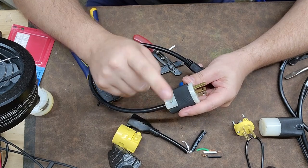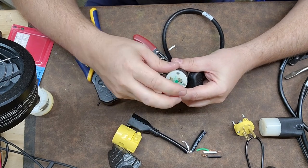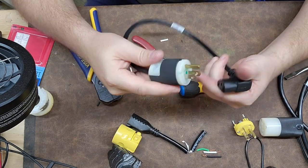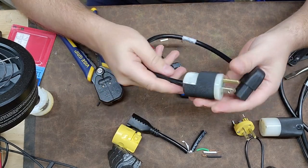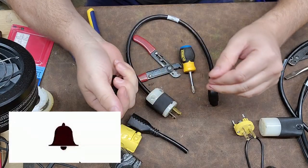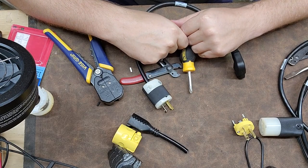Once you have the cord re-terminated, always do an electrical safety test on it: check the integrity of the ground conductor, check your mains voltage to make sure you're getting full mains voltage, and also check the polarity on your electrical safety analyzer. By doing all of that, you are good to go to use this cord on a piece of medical equipment. I hope you liked this video — short, simple, sweet — the correct way to do a plug-in on a cord. Thanks for watching.